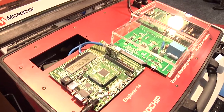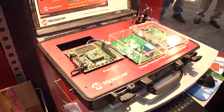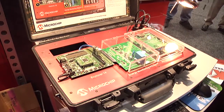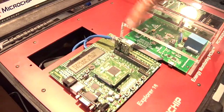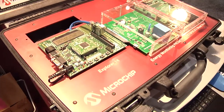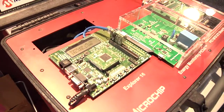The PIC 24 is taking that power information and periodically sends it up to a web — serves up a web page and updates that web page. It's running about every 10 minutes, and it's doing so with this 10/100 PIC-Tail plugged in. Underneath, not seen, is a wireless router 802.11b. So this is plugged into the port of the router, and the router is serving up the web page wirelessly.